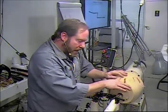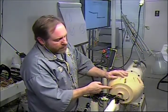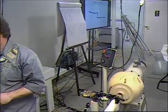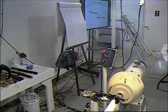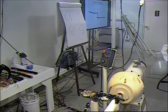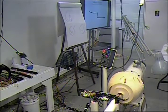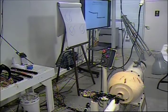Even though the angle of the dovetail is good, my undercut is good, I've created a new problem. This surface is too big. So that undercut shoulder, my jumbo jaw here, that undercut shoulder is going to be wider than the biggest diameter of my chuck jaws. So when I tighten down my chuck jaws, I'm creating a gap. But it's a super simple fix.